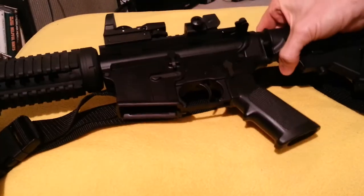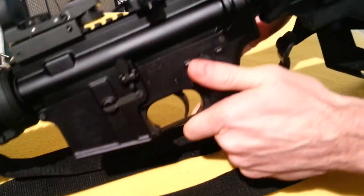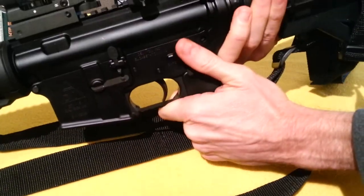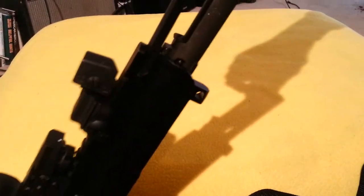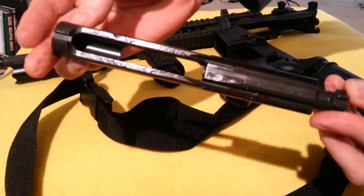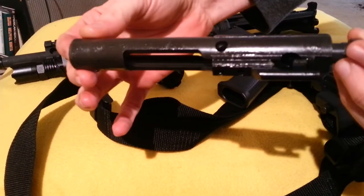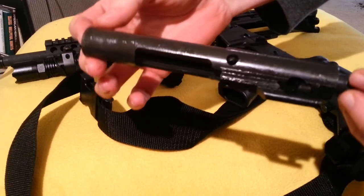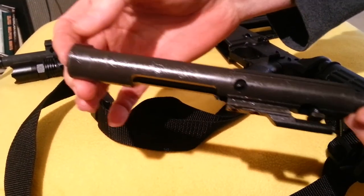Here's the other one — this is my AR-15. I'm going to take the bolt out real quick, just pop that pin out. I put this grease on the bolt as well, a very light coating on all the wear parts. I use the oil on the parts in between, like the hammer and where pins are inserted — places where you can't really get the grease and are kind of pivot points.